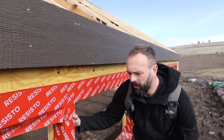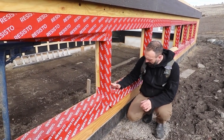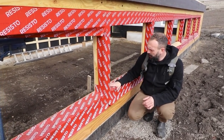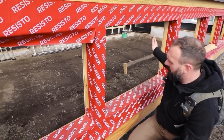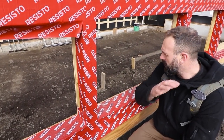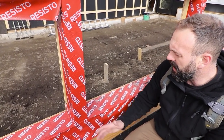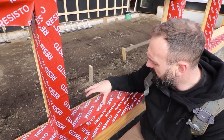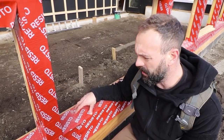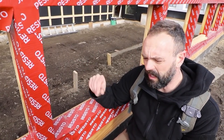Down low we've got our knee wall, which we talk a lot about when we're designing passive solar greenhouses. The knee wall sits on top of the concrete footing, and on top of that we've got our windows which will act as our vent wall. We're going to have mechanically operated vents that open and close based on temperature, which will allow fresh cool air to come into the greenhouse. The mechanical operator we're going to use is a linear actuator, which will run on a 24-volt circuit and relay, going back to a central brain that makes decisions with regards to when these windows should open and close.